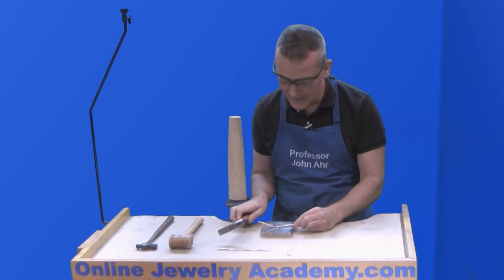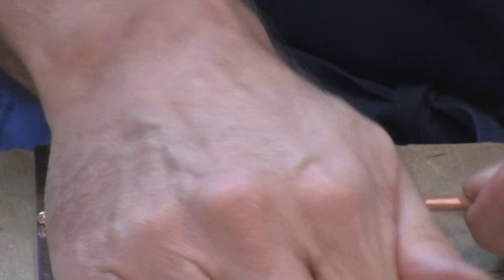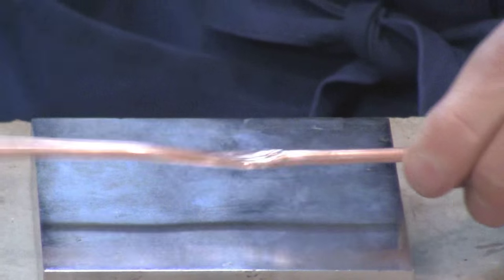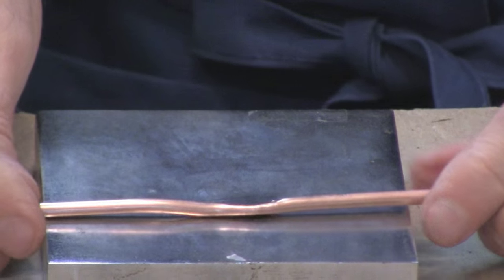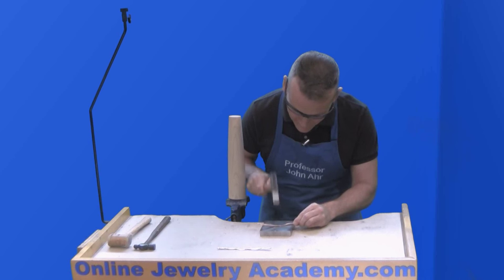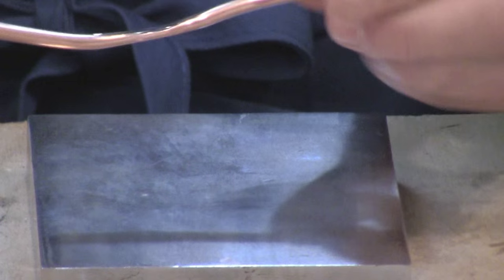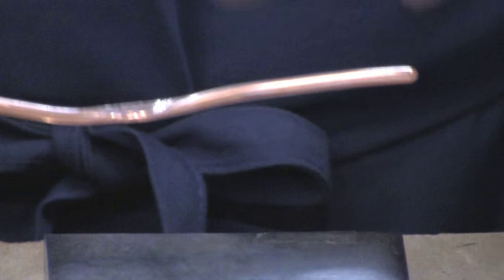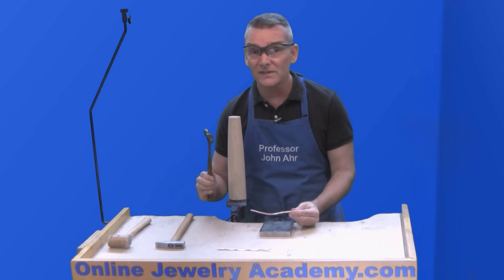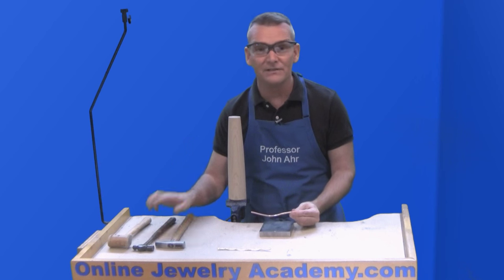I've got that shape beginning to start. You can see how this is beginning to bend up. All you need to do is just turn it around, push it towards the flat surface, or you could use the mallet, and then it's back in shape again and you can continue to hit it. You basically just strike it to create an interesting texture and to stretch the metal out. You can also substitute with a ball-peen hammer if you don't have the cross-peen — you'll get a slightly different shape, but it's still going to look cool.